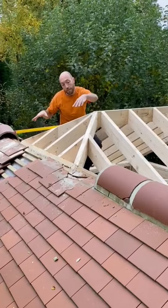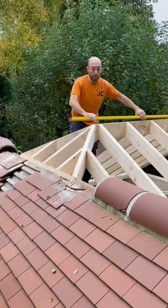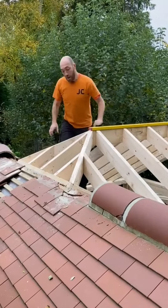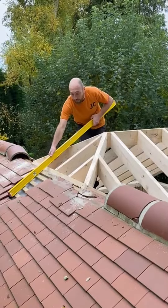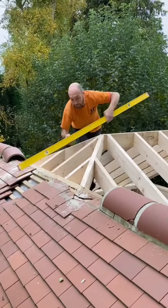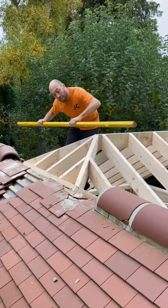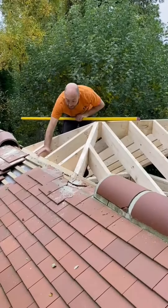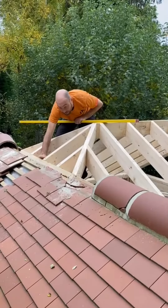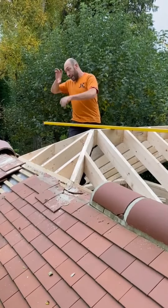When the roof tiler puts his batten on, when I do this back bit here for my little jack rafters to cut in, I will cut a smaller piece. I'll do the same thing — getting it straight — as long as it doesn't touch the ends of the lay boards. Then I'll follow the top of that line all the way through and the bottom, same as the timber that I'm putting back as like a lay board. When I've done that, that will mark my lay boards.